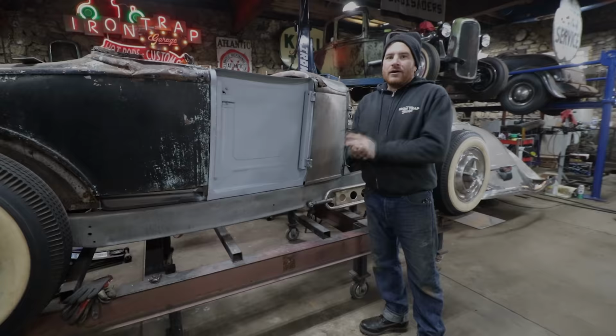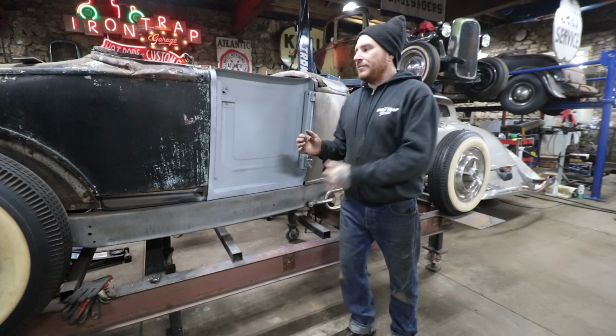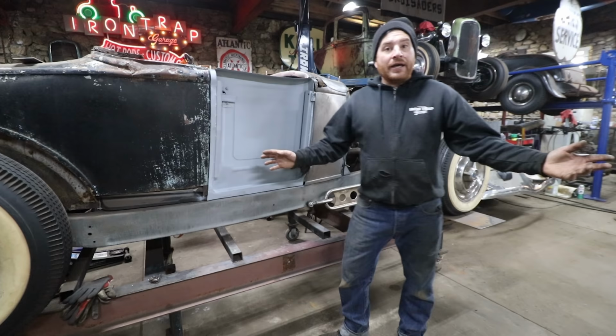Alright, so I did a ton of welding. There was real delicate welding where we were doing all the flanges on this. It is just way quicker to do it that way because I could just cut the flanges. And as you saw, I made really large pieces, so I didn't have to worry about burning away or having major warpage. By leaving those real long pieces on either side, I was able to then just trim it to exactly what I needed, which made things really simple. Then I went around and welded everything, did the bottoms, and everything is good.